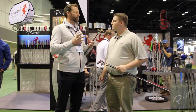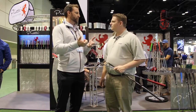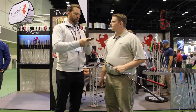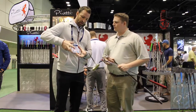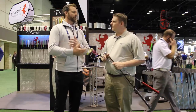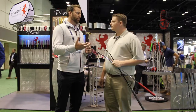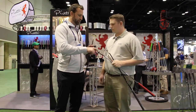The milling process — we believe that's the best way to make a putter. There are two ways you can do it. You can cast a putter, where you take hot metal, pour it into a mold, and that's what you use — but you'll see a lot of those putters use inserts to make it feel better. We don't do that. We take a block of steel. The putters start out in a block about like this, and we get two heads out of each piece. There's a lot of wasted material, but it's the best way to do it. Our tolerances are really, really tight, and with the materials that we use, it gives it the best feel.